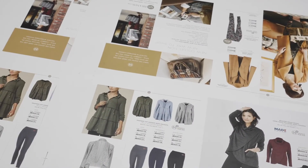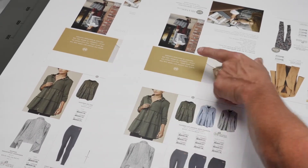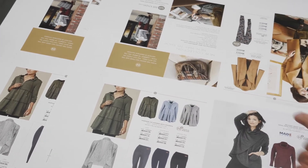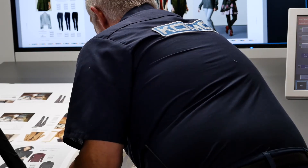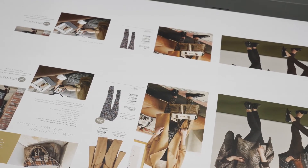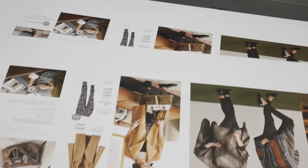As you can see here, this is sheet number one with a standard magenta density. Here's sheet two with the density 10 points lower. You can see it pretty well here, and you can also see it in this image very well too — and that's without running sheets to get the ink out of the rollers, just using the ink ductor to accomplish that.